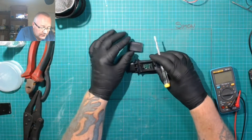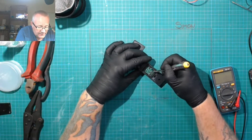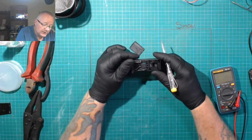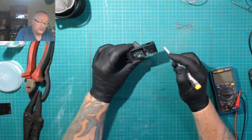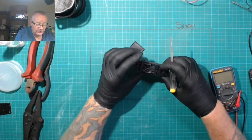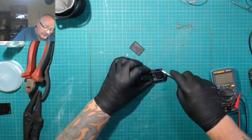We've got an 8-pin chip in here which I might try and clean off to see what it is, because if we can identify these then even a simpleton like me can make approximate guesses as to what's going on. The air is obviously going to go in, swirl around, and come out here. Inside that chamber somewhere we've got the hot wire and this circuit is just going to do a differential and figure out what signal to send.